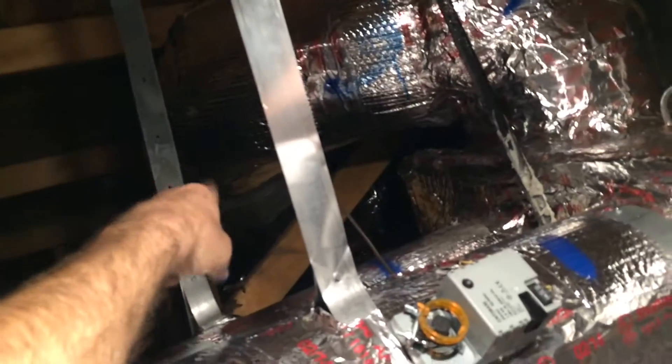Coil — I put an SS2 in there. Well, there it is. That's the Platinum ZV. You got your dampers here. That zone over there, the one going out — I actually put a manual damper there before the modulating damper, because that zone being at the end of the coil just got too much air. Even when the zone opened, I wanted to be able to adjust it, as that's my daughter's area and it's always had trouble. I just wanted a little extra control, especially going into the coil with not a lot of room in here.